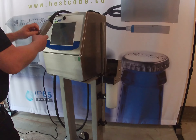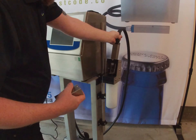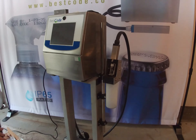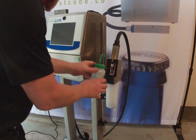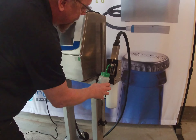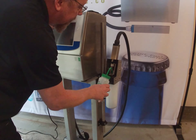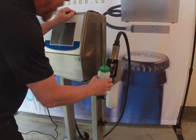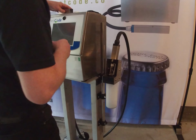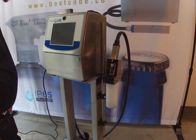The beauty of this is when we come to start the print head up — if I take the cover plates off, this whole print head just slides down inside the slot and makes it perfectly accessible for washing the print head down. Using the cleaner here, you can see I can get at the nozzle at the top, between the charge electrode where the green LED is, the phase detection either side of the deflection plates, and then down into the return gutter and around the bottom face plate, cleaning it all the way down. Now that it's clean, I can start the jet up to check the alignment, the modulation, anything like that — all hands free.